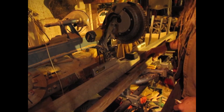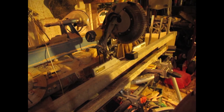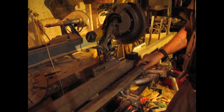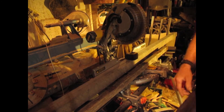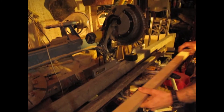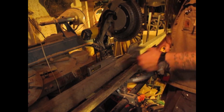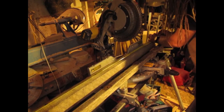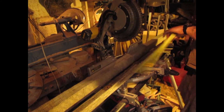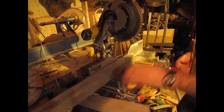Okay, so here we have an old wheelbarrow handle. This is off the same wheelbarrow that the other handle broke off of, but we're going to make our new handles a little bit bigger. Here's one that I've already made — I haven't drilled the holes in it yet — but we're gonna make it a little bit thicker. First thing we're gonna do is cut this one down to length, and we're gonna hold on to that off-cut because we're gonna need some wedges later on.